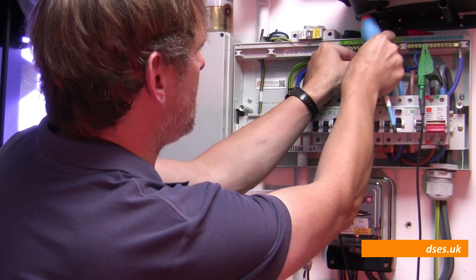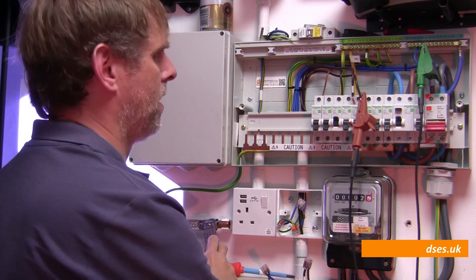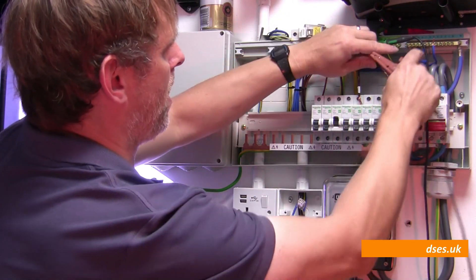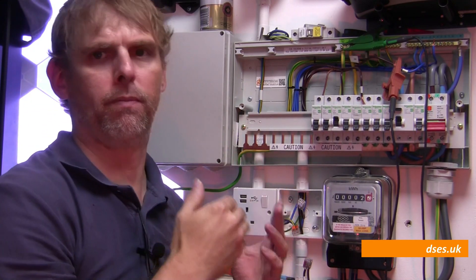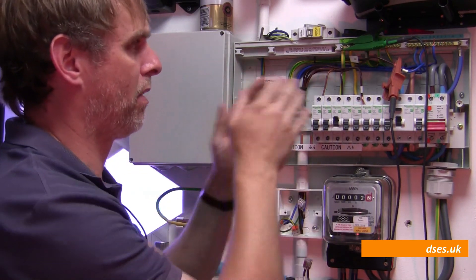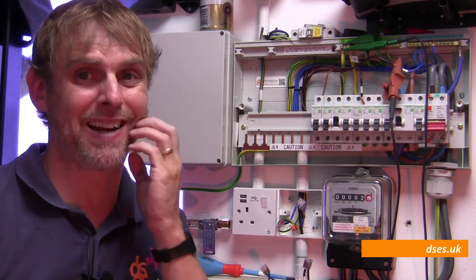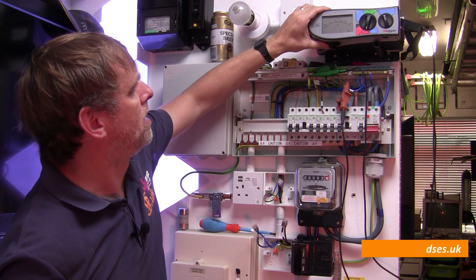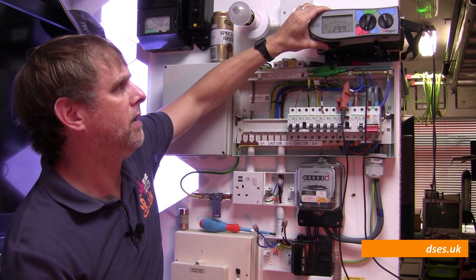So let's take the circuit's earth wires and connect them back to the main earth terminal. I'm going to place one probe on the main earth terminal and connect the other probe to a brown and a blue wire at the same time. I could do these tests individually — line to earth and neutral to earth — but I'm going to do both together to save time. If the number doesn't come out as optimally as I'd expect, I can break it down further. Let's hit the test button, and again because there's no accessories in place and it's new wiring, we expect to go off-scale high — and indeed we have done so.